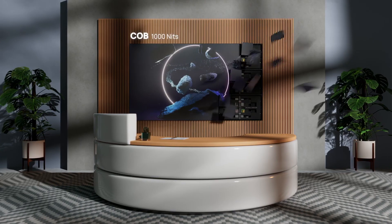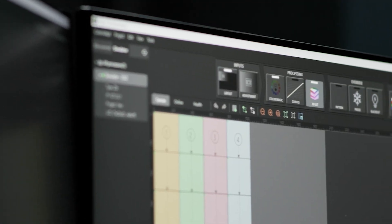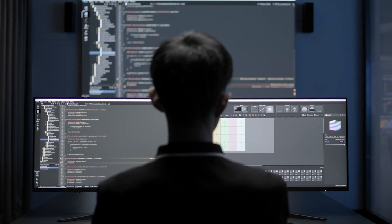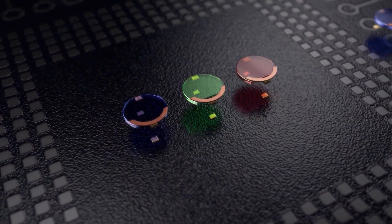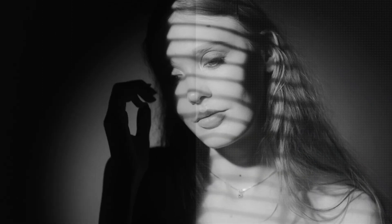COB displays also eliminate the need for binning diodes. All COB products are calibrated for chromacity in the factory — this is a game changer. No more worrying about how many spares you have left; COB diodes can be matched to any existing project based on software configuration alone. On top of it all, chip on board technology excels in reproducing deep blacks with unmatched precision, contributing to a potentially higher contrast ratio compared to traditional SMD displays. Because the diodes are not encapsulated in a package, they basically disappear against the black of the masking on the circuit boards.